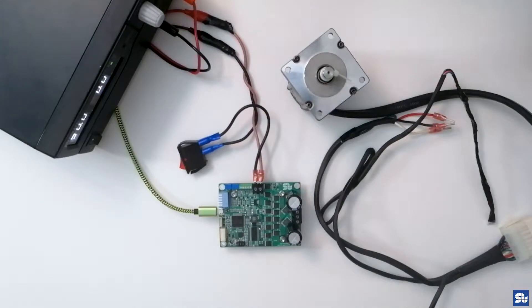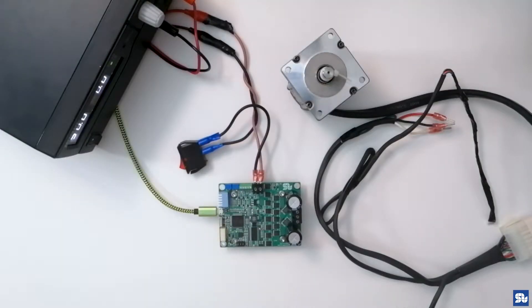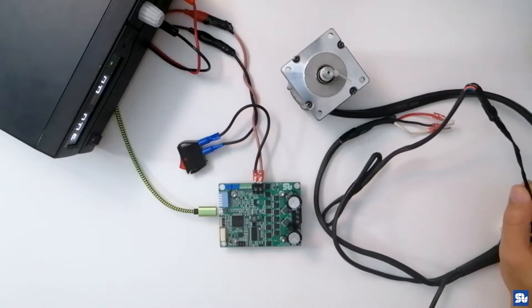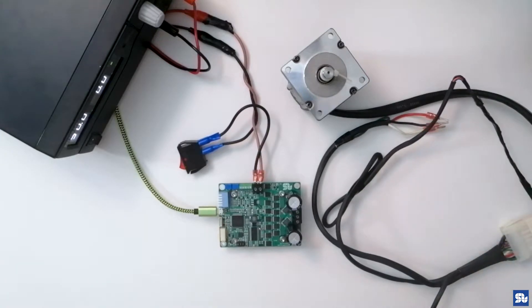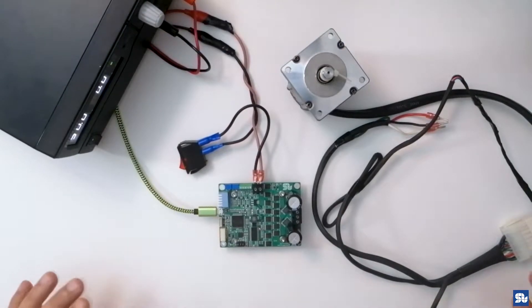In this video I'm going to talk about how to properly connect your three-phase brushless motor to SOLO to control it using incremental encoders. You can control torque, speed, and position if you have incremental encoders mounted on your motor. What matters is properly connecting the encoder wires to SOLO and then the motor's wires to SOLO. Once you find the correct wiring it remains like that forever.